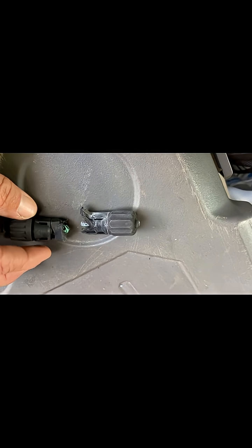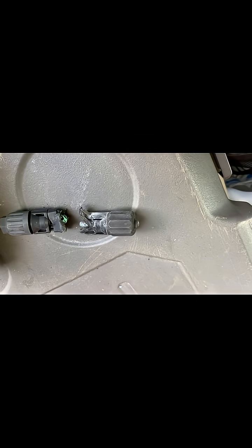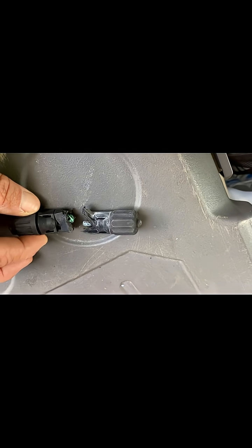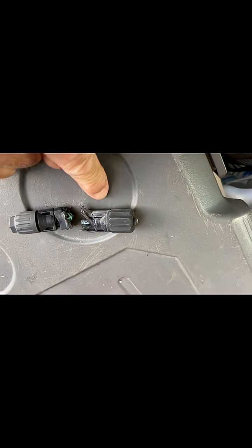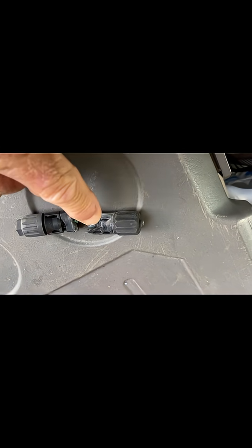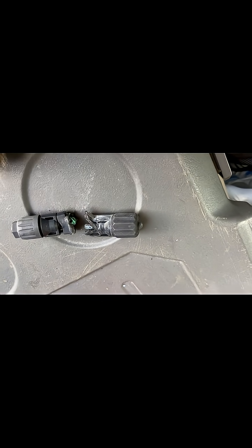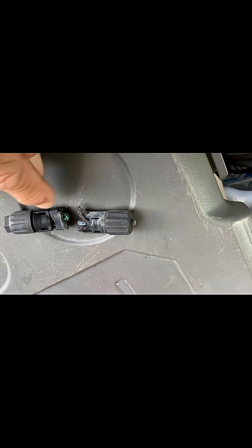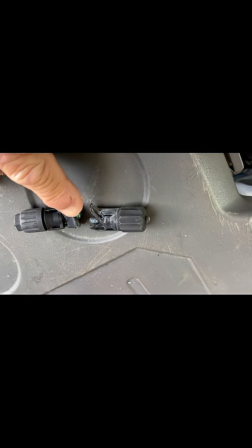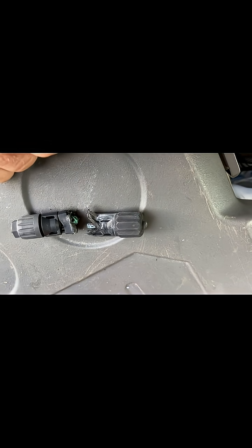That presents quite a dangerous situation on your roof, or in your RV or caravan or anything like that. So it's important that you use the same type and brand of MC4 connectors. They can't just be MC4 connectors — they need to be the same brand and the same type, because once you plug them in they may plug in, but you can't see the connections obviously, and you've got no idea until this happens.